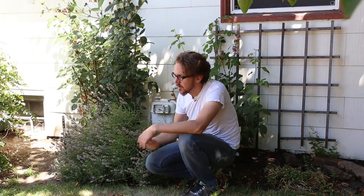Now obviously I'm just a guy, a homeowner, kind of working on this thing. Adding a gas line is probably one of the more dangerous things because, you know, gas, flammable. You want to exercise some common sense and be comfortable with what you know already. This is just how I did it. Anyway, let's get started. First thing we've got to do is shut off the gas, obviously.